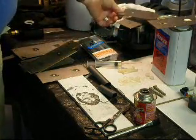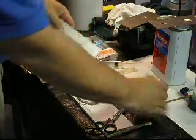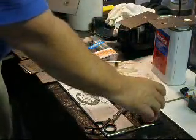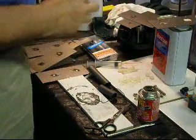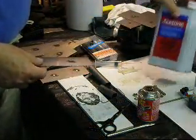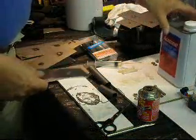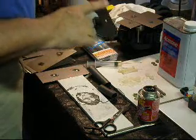What I'm doing is coating the ends of the plates with brush-on electrical tape. Unfortunately, it evaporates so quickly that all I got was little globs. So what I discovered is that if I put in a combination of the electrical tape and acetone, it dilutes it down so I can brush it on evenly and get a good contact with the plates.